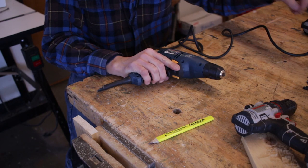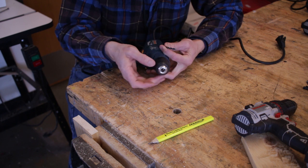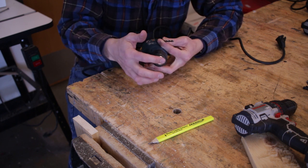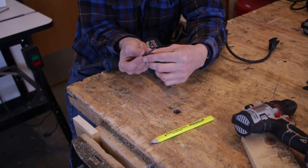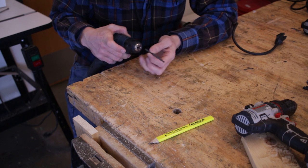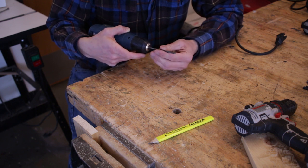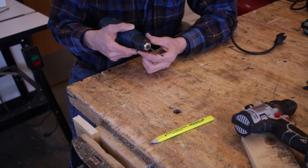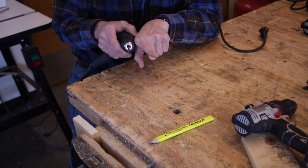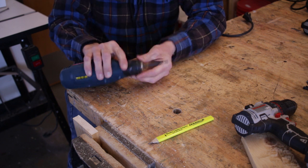If I need to install a drill bit in any drill, I want to make sure I unplug the power source first — I don't want any risk of it turning on while I'm installing a bit. The piece on the end is called a chuck, and as I spin it, three little teeth draw closer together or farther apart. We fit the drill bit in between there and tighten it. I need to expand the jaw first, large enough to get the bit in. I don't want to clamp onto the actual cutting portion — only the smooth part of the shaft. I'll tighten it, making sure it's centered and not canted off to the side.